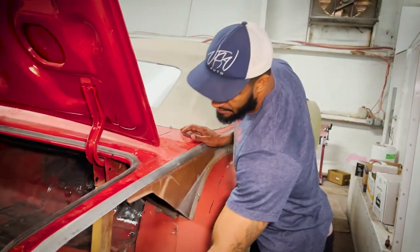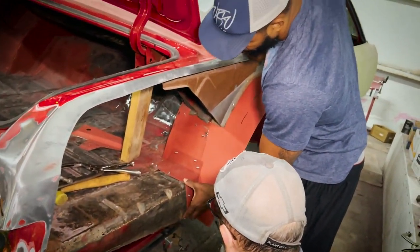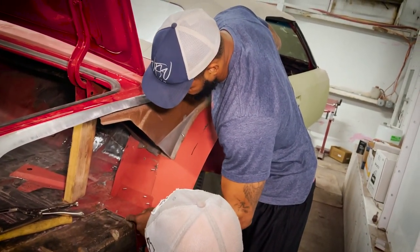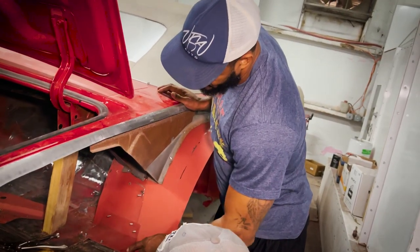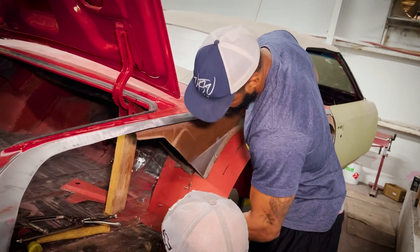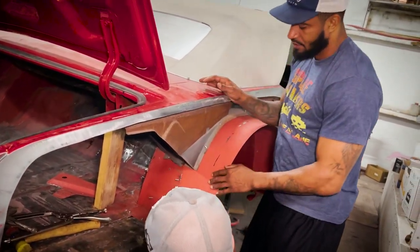When you grind this out, I'll have him photo it. When we weld this in, are we going to cut this and butt weld to this? Yeah. Okay. This is just setting up to making the... it won't be on top of it like this — it's going to be into it. And then all this is eventually going to be all clean, ground, and flat welded.